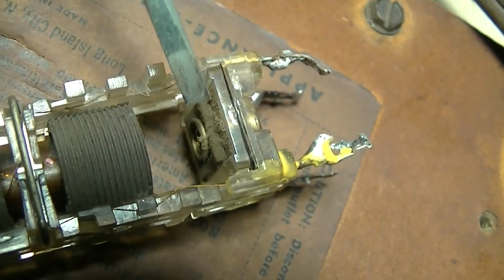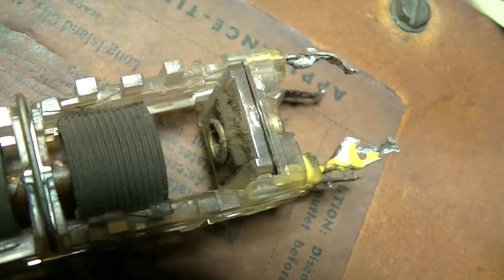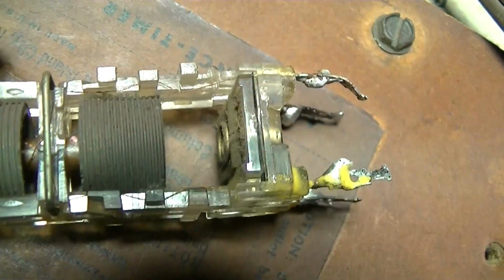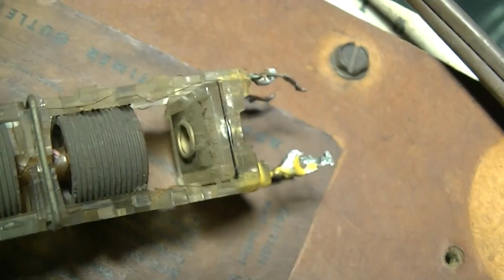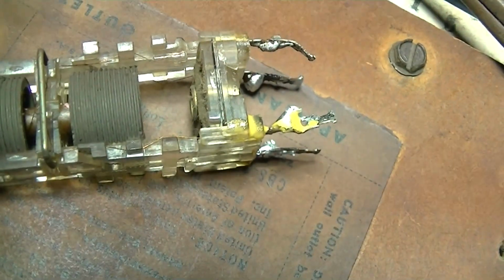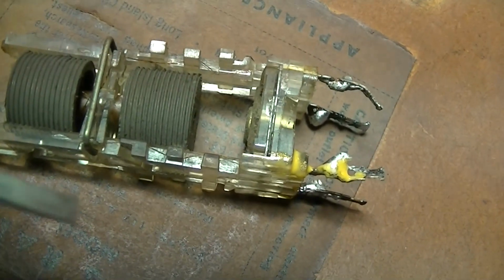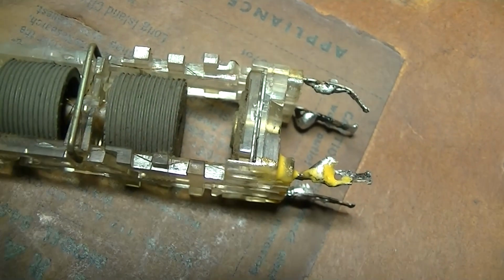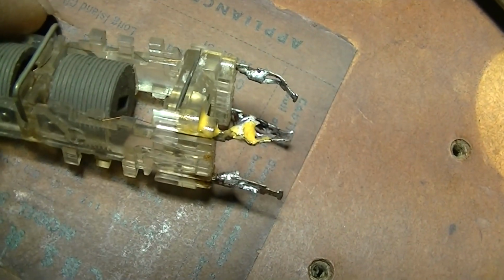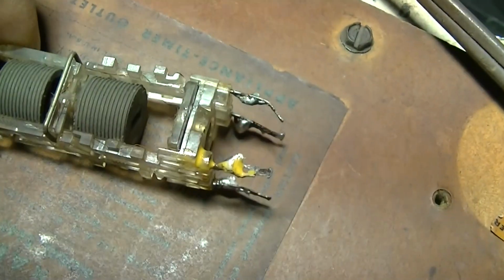And basically that's got two moon-shaped things that comprise 2 capacitors. And you can see what they've done here is they have a brass rivet going through there, and like a spring locking washer on top to keep pressure there pushing down on the mica wafer. Because probably what happens is these come through and then there's a tab bent over. So how do we delete this thing? We basically just want to get it out. So let me analyze it and we'll figure out how to get rid of it. It might just be about drilling the rivet out.